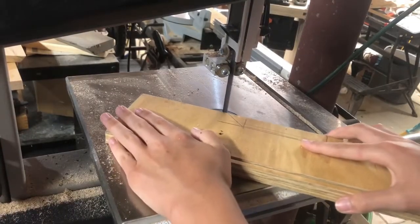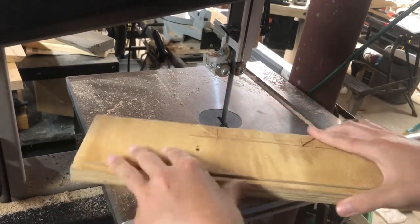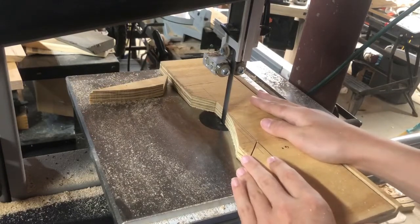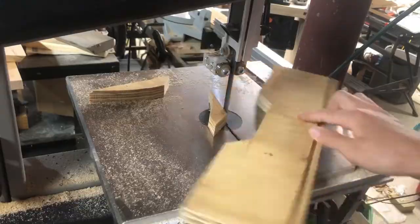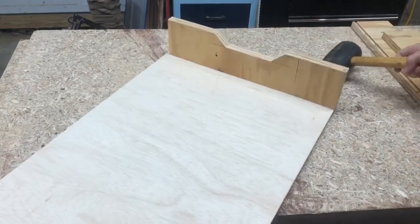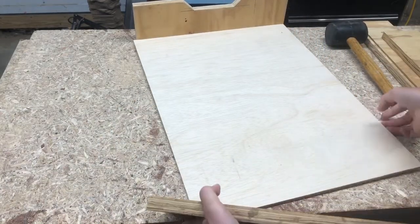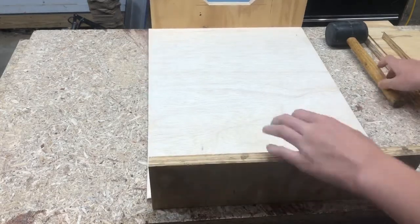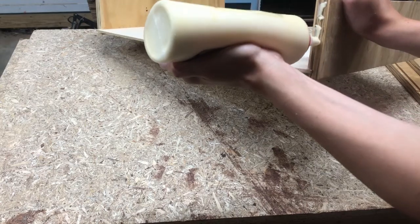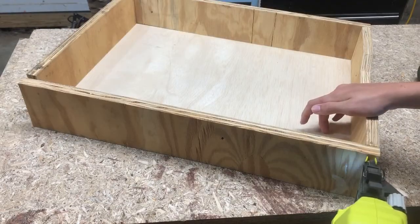Now I'm cutting a handle on the front-facing part of the drawer at the band saw. It's just a line with two 45-degree angles coming off, which allows for no drawer pulls but still easy access. Now I'm assembling the drawer — I start by putting the quarter-inch plywood into the rabbet I cut earlier. It was a pretty tight fit so I needed a little negotiation with the mallet. I put all the other sides on, making sure everything is seated, then put glue on each face and came back with a brad nailer, giving about two or three brad nails per side to keep it in place without clamps.